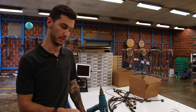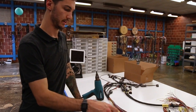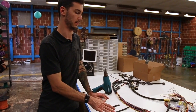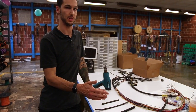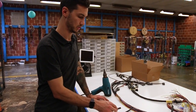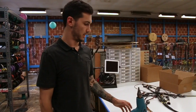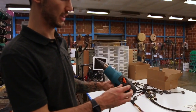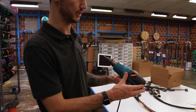So now we're going to show you how heat resistant these three sleevings are. Keep in mind that we're using the highest heat resistant version of each type. It's going to be hard to tell when you're buying a harness which one the manufacturer chooses, but we just hope that they're using the highest heat rating of each. This heat gun goes up to a thousand degrees — we usually use it at about six hundred, but we're going to turn it up to max level and see what these three sleevings can take.